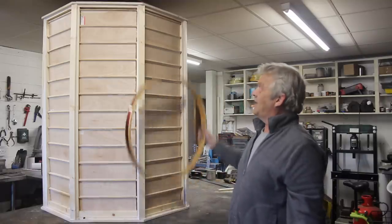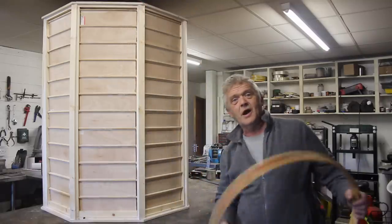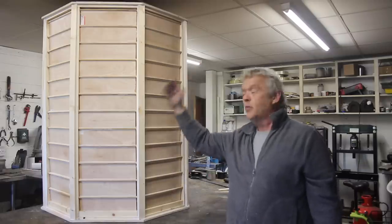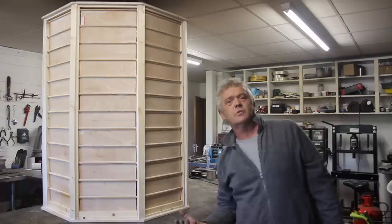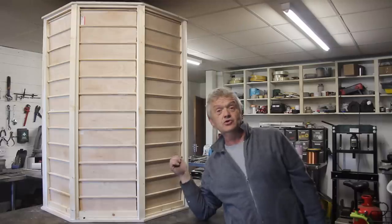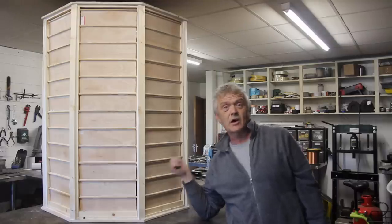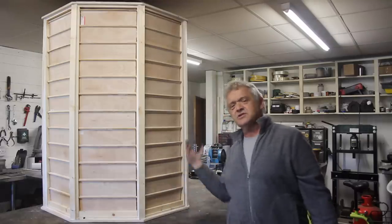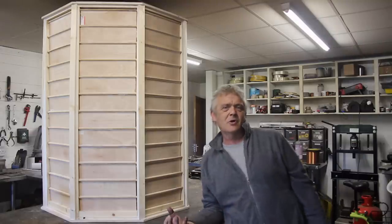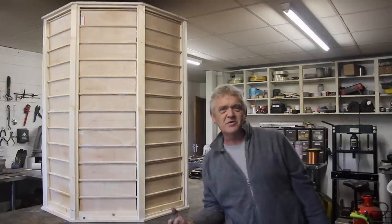We've got that swept area — it's very much bigger. And of course that wind, even despite the leakage, is going to be more because we have a bigger area. So one thing we can pretty much guarantee: this thing is going to be much more efficient than just a wind turbine by itself because it's capturing more wind area — it must be. Of course, it's going to be more cost effective because you have to build a tower anyway, and here you're building a tower that's going to do something useful.